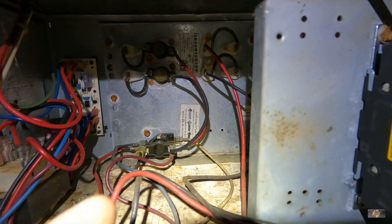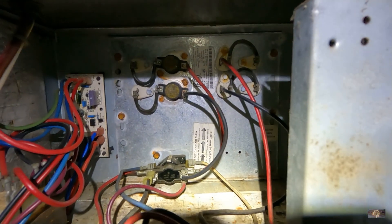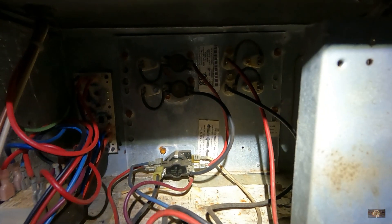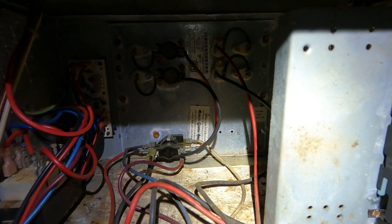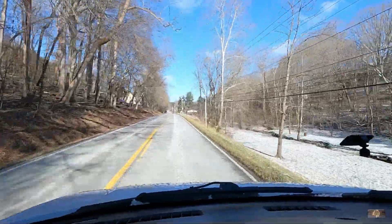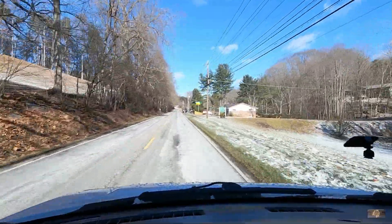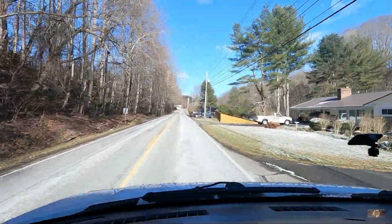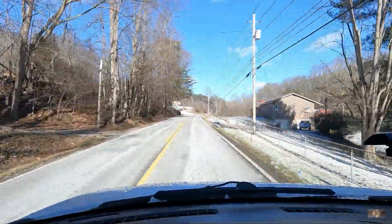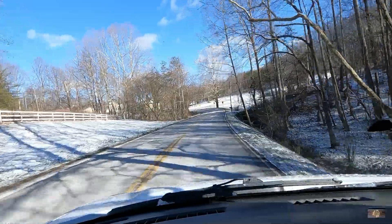I went ahead and put an amp clamp on the two heating elements. We had 20.4 and 20.3 amps on each element — so we're getting 20 amps on each of them. This is a 10kw heat kit on this 2.5 ton heat pump. I'm going to go ahead and shut this door so we're not pulling air in past the coil — I want that air going through the coil. I tested out on that one, put some probes on the return and supply, everything tested out okay. I asked if they wanted me to hook up probes to the outside unit and check the charge while I was there — they declined, didn't want to spend the additional $40-$50. I figured it would take about 30 minutes total. Unit kicked right on after I replaced that inline breaker — I call that one fixed.